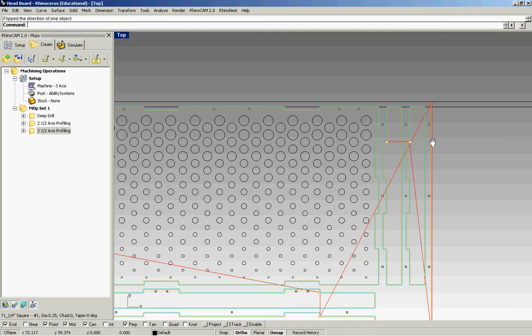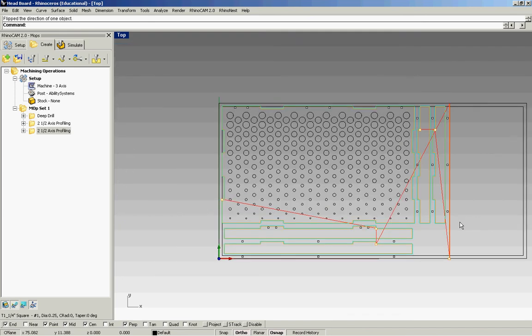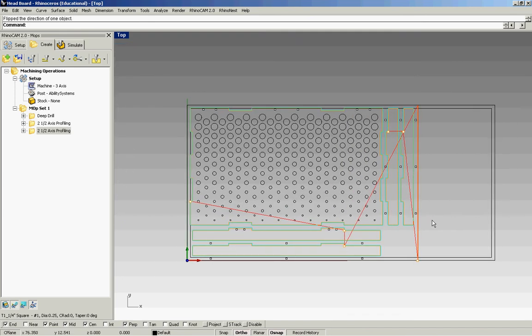Now, just real quick on placing your screws: they need to be at least a half inch away from any geometry that you're cutting. And this will ensure that the bit misses the screw. And that's if you're using the quarter inch bit, which we're doing here. And this concludes our profiling and the flip mill series.